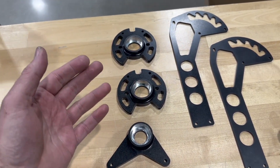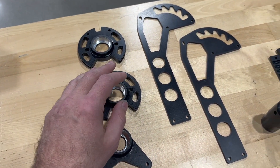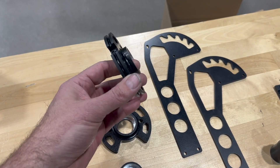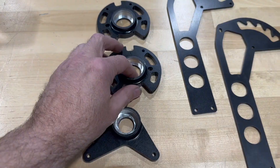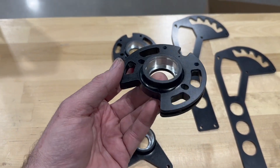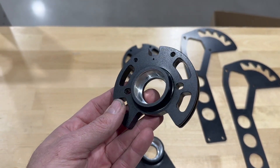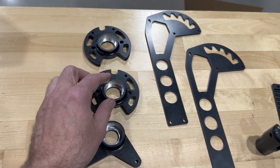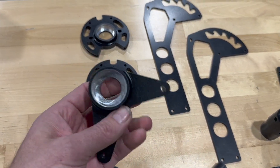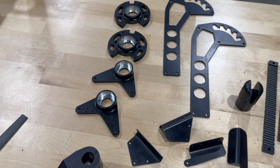It's fine and will certainly last a long time, but now's the time to do this, and I do all this with my robotics business. On parts where bearings fit into them, I had the anodizing shop mask off the bearing bores — I didn't want to add any thickness there. I wasn't sure what tolerances RANS is holding to for bearings, and the last thing I wanted was to make it too tight to press in the bearing. They just apply a film, kind of like tape, to any areas you don't want anodized.